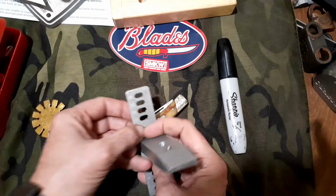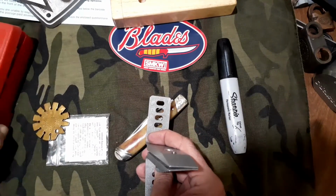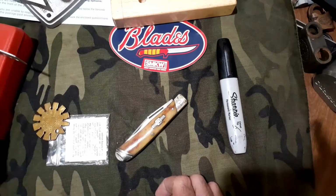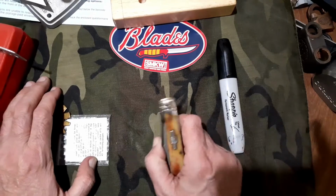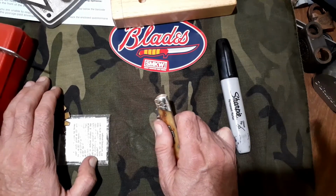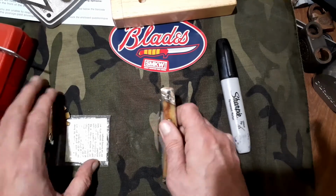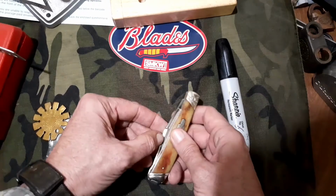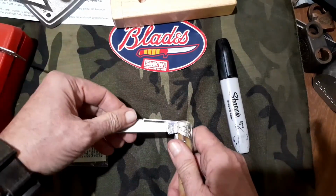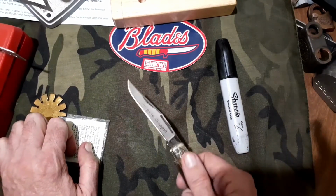17 is better for razor blades and kitchen knives or anything like that that you want real sharp. The thing about a really sharp edge is the denser the material you run into, the more likely that edge is to roll or chip or basically dull over faster. A razor edge can do fine against paper for quite a while, but when you start hitting wood or anything denser, then that razor edge will probably dull after a while.